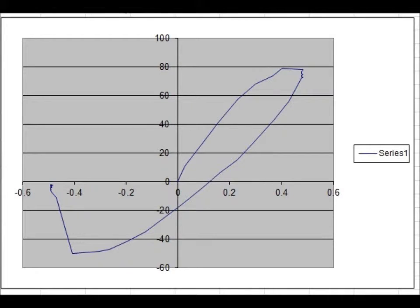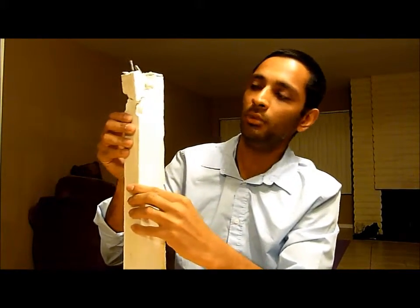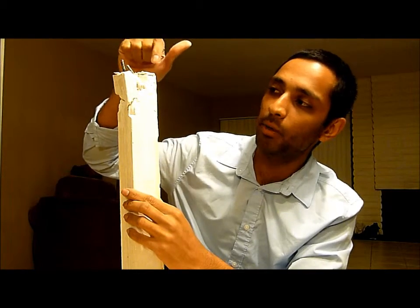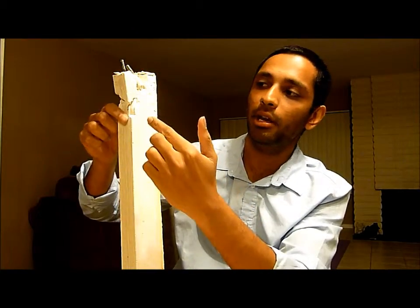Test results of our column show the performance and the failures after testing. Our column was supposed to displace half an inch, 1 inch, and 1.5 inches respectively in each direction, withstanding 40 to 60 pounds. As you can see on the graph, our column withstood about 80 pounds only for the initial half-inch displacement, and it could not go past 1 inch to 1.5 inches due to shear failure on top. The reason for this was that our column was not dry enough and was still wet when we tested it, and an initial crack due to high plaster of Paris content caused it to crack from the top.